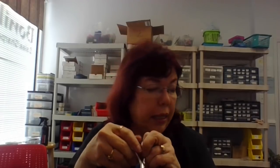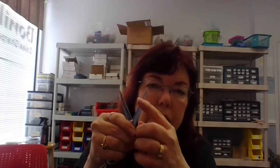And these two have tips that don't even come together. That's a bending handle, which is another video. So both of these, the way I would fix those is to work the ride line, the way I do most of the shears that are just a little bit out of alignment. I just correct it with a ride line. Sometimes the ride line might look kind of ugly, and I'm going to show you this one. See if you can see. Yeah, you can see it in here.